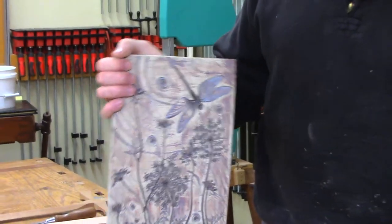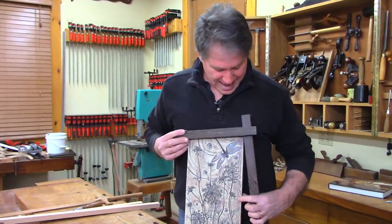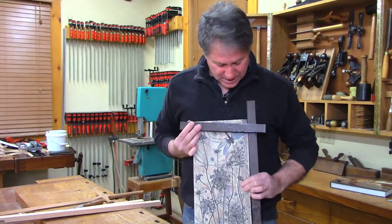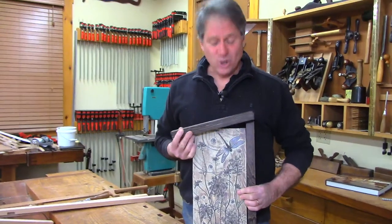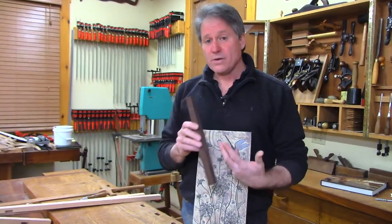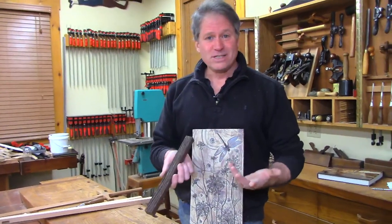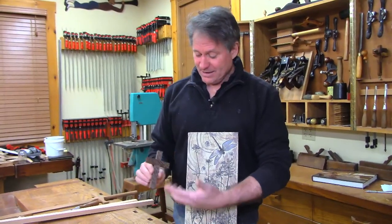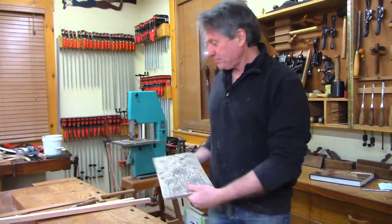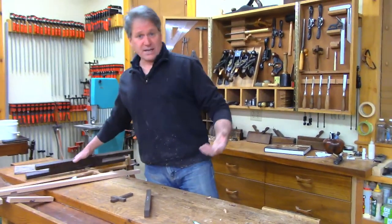Really beautiful panels. So anyway, I thought I'd take this and actually make a frame for it and have the corners lapped like that. So I'm going to lap them over like that. So it's a little more, rather than just your picture frame, they'll extend beyond the corners a little bit like that, sort of. Is that making sense? And then it'll be recessed into the back, and I'll probably give this wenge a little texturing, because you can put it on a wire brush wheel on a grinder, and it will take away those lighter colored bands and create a beautiful texture. That's one of the nice features of it. These little crosses seem like they're nice enough with just the lively figure there. But one of these days, I'll share that with you. But that's a good use of a cross lap joint. But that one's going to be out on the corner of the piece rather than the standard miter.